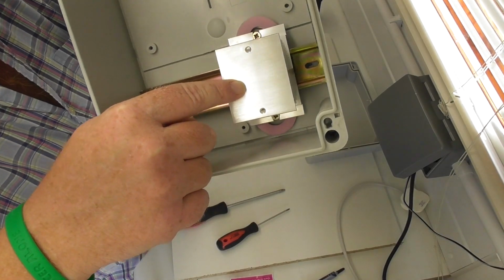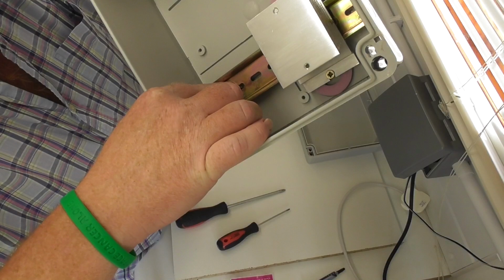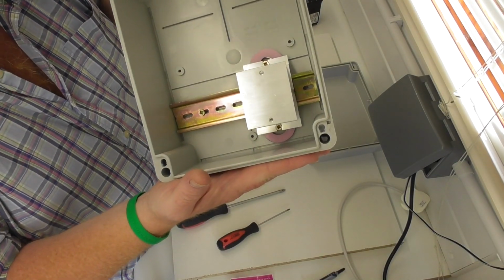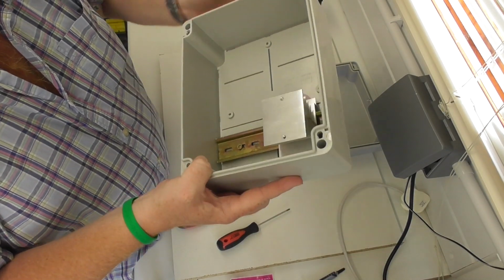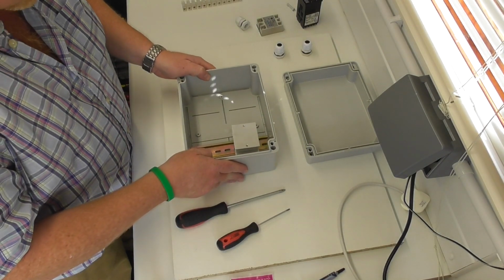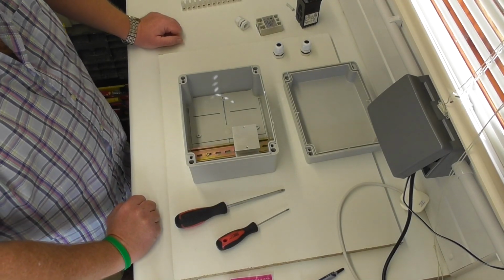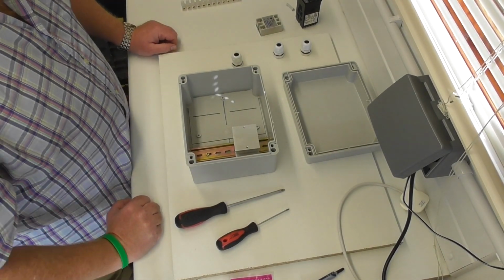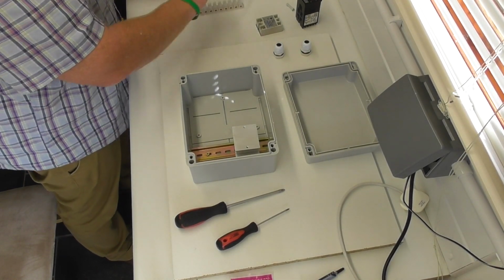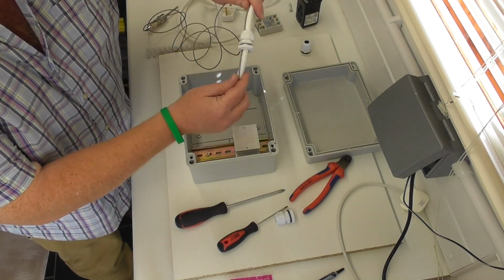So, heatsink, washers, DIN rail, washers. That is pretty well insulating this box as best as I possibly can do, without obviously sticking fans top and bottom to really keep it cool. But I'm thinking that's going to be okay. So let's now 100% decide where we're going to bring in these glands, and whether I'm going to be able to fit the probe and the supply in through the same gland. Okay, so yeah, it fits, if you can see that.